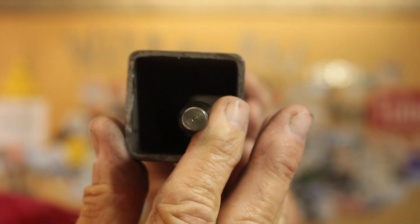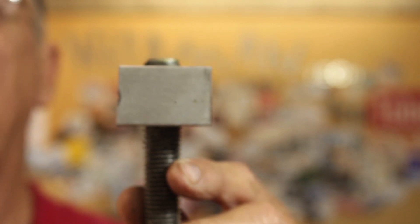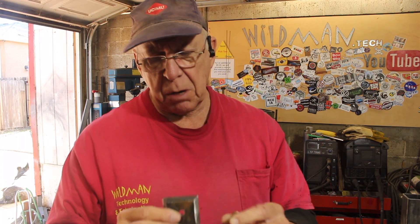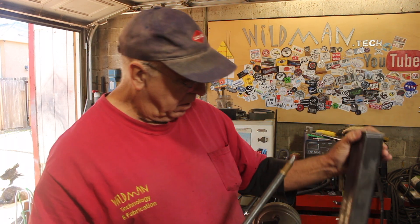That's something I knew all along because I've seen a bunch of them. But something I didn't realize is a lot of them have several different size wheels for the bottom. I've ordered a 6-inch wheel that's going to be the hammer wheel, and I'll use a couple of different wheels I have on hand as the anvil wheel. Checking the alignment here — this is in the middle on this end, but it's not in the middle on this end, so I'm going to need to make some adjustments so it doesn't try to flex that screw. It's ever so slightly a parallelogram. The more I think about this, the more I think I want a bronze bushing in there. I wasn't able to get a thrust bearing, but I did get a flange bushing, and I think I'm going to put that in there — but I'm going to have to drill this out first.